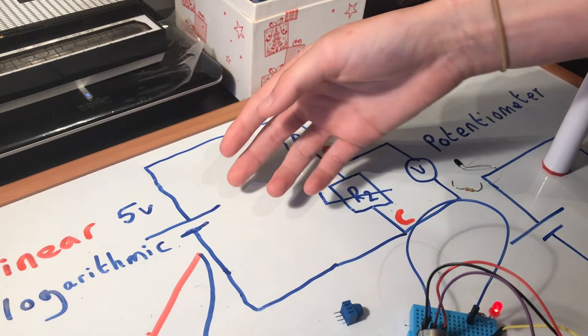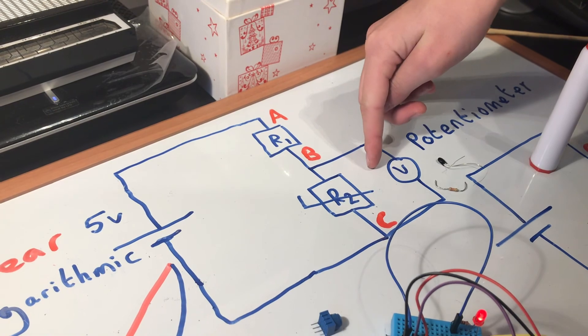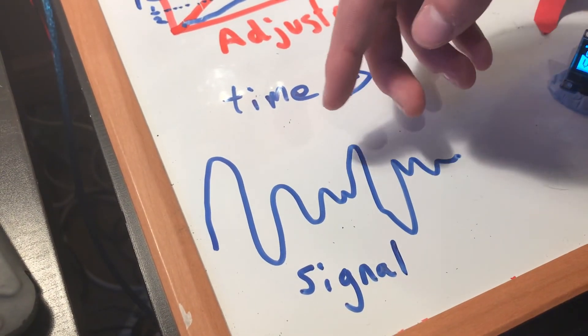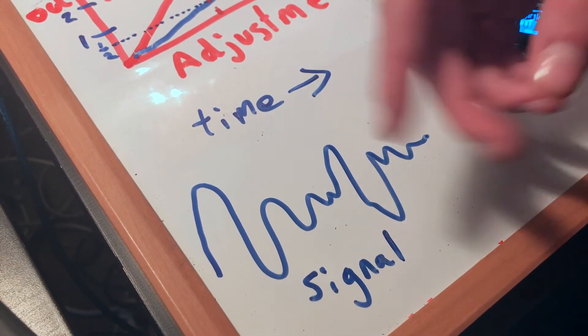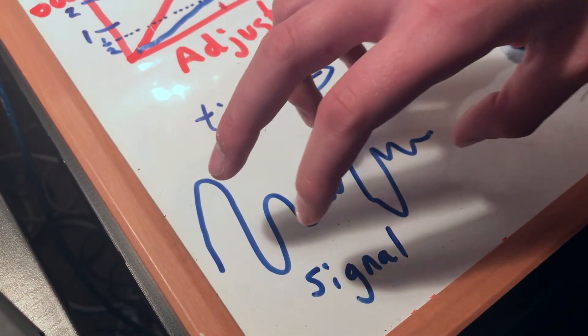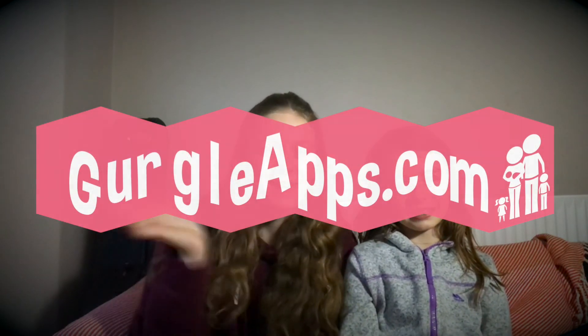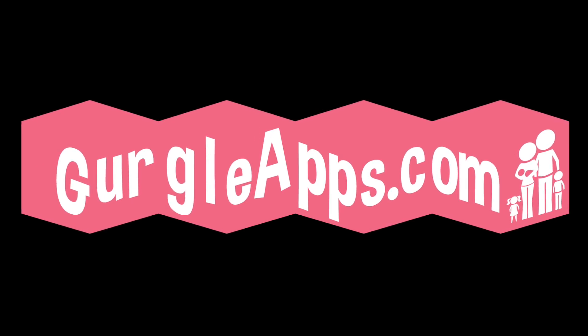We've dealt with a fixed voltage coming in from a battery or Arduino, and used our potential divider to reduce it. But with a varying signal — from a microphone or guitar, for example — the voltage is changing all the time. Feeding this into a potential divider still gives a reduced voltage, but that reduced voltage varies just like the input signal. This is called attenuation — you scale the signal down by a certain percentage. Thank you and well done for sticking around. If you liked this video, please give it a thumbs up and subscribe.